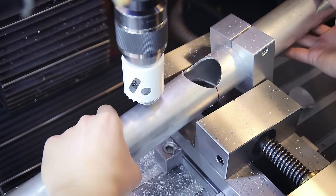I only use them temporarily, and this really drives home why I got this welding table — because as you can see here I can quickly set up a fixturing solution that not only holds the parts in place but also allows me to check for distortion after welding, just like I did with the main frame. Since I'm building the same part twice, the fixture also makes sure that both pieces end up identical. It really reduces the chances of messing things up, because as soon as something doesn't line up inside the fixture it tells me one of the cuts must be off, and I can fix that before welding.